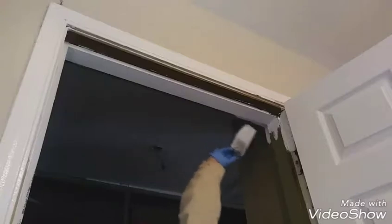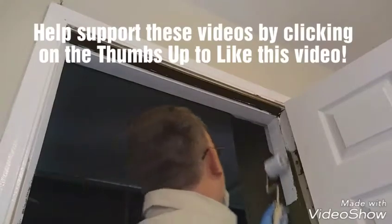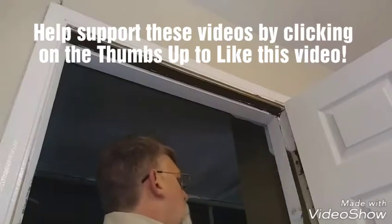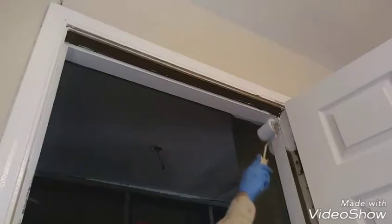If you get an ultra smooth, or even some of them are those little foam mini rollers you've seen, those will give you a nice smooth surface, but it's a little more difficult to get in all of the shape and the conformity of your wood trim. Using that 3/8 inch nap gets in there really well, but like I said, leaves you with just a slight bit of texture on the surface. So those are some options for you.